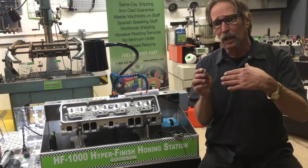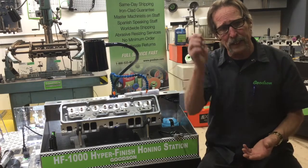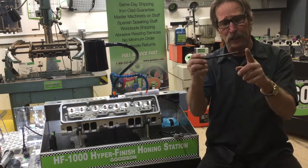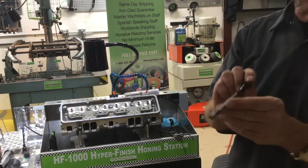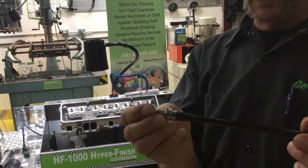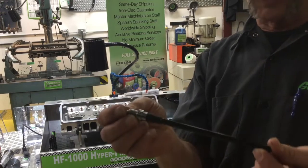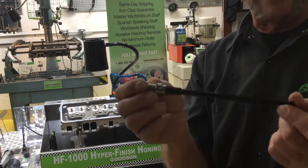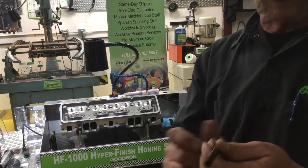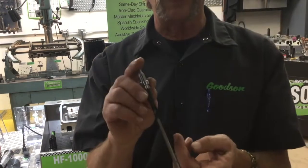As you acquire different ranges and different dimensions of the valve guide diamond sizing system, they'll come just like this — black anodized, hard chrome, longer diamond, more consistency in the manufacturing. It's a beautiful piece. I'm now reassured that availability will be more consistent, the quality mandrel-to-mandrel is impeccable, and the interchangeability of these parts and replacement parts going forward should be back up to that Goodson standard that you've enjoyed in the past.